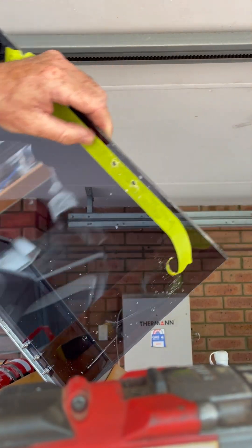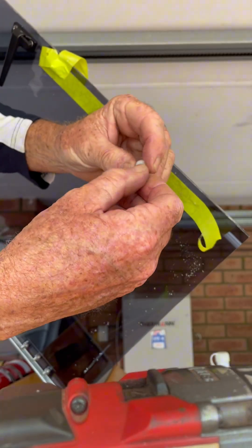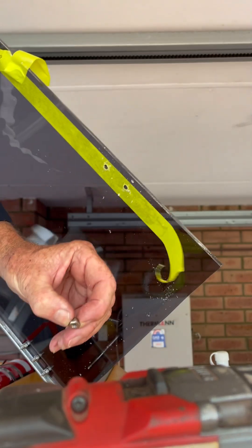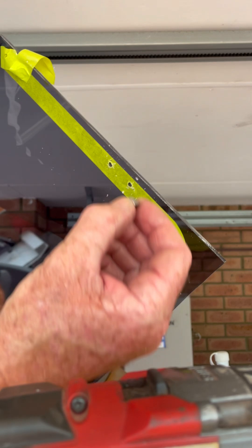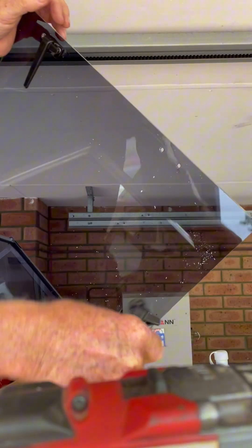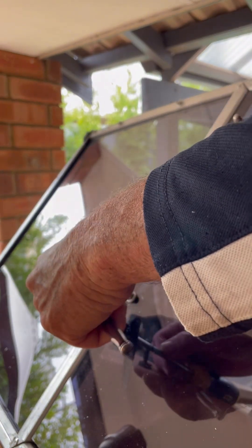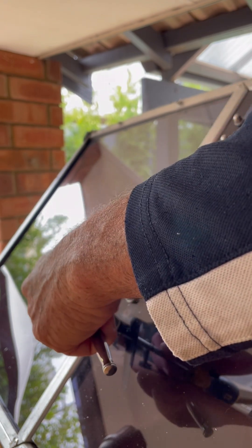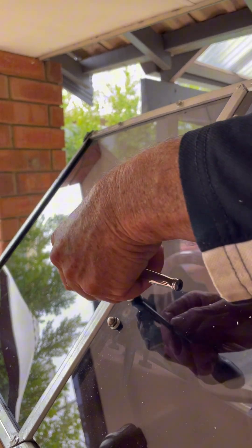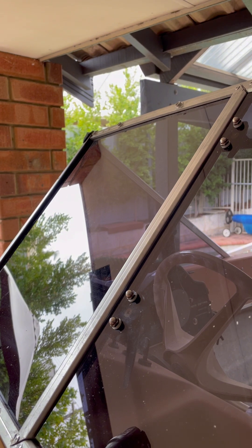The other thing you can do — which I've done just here — is put some plastic washers under the nuts if you can find them, or teflon washers like this. I've got captive nuts here and I'm placing these plastic washers underneath them. I'm going to put the catch on now. Also be very careful when doing nuts up on acrylic sheeting that you don't over-torque them — tightening them too much is going to be another reason why you'll shatter or crack the perspex or acrylic sheeting.